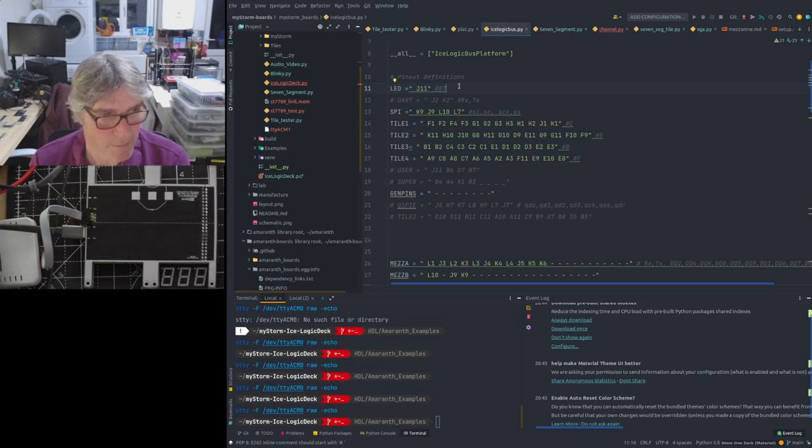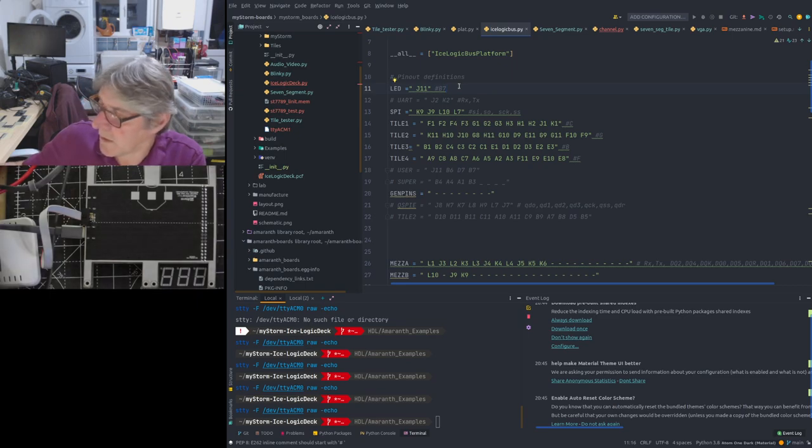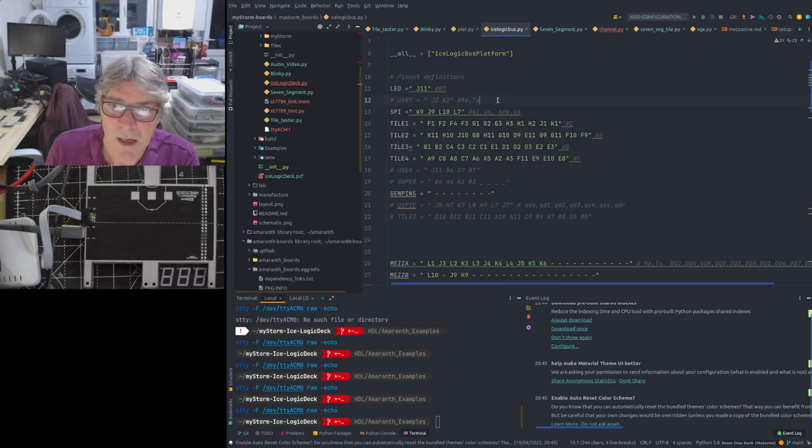So the color we get out is amber, which is a combination of the green, which is always on, and the red from the done signal. So that's how it starts up. So if you were to look at the board, you'd see the orange of the STM32 mezzanine board, the BlackIce NXT board, that is an orange, that RGB LED. Likewise, the FPGA LED is also orange. Confusing much, but let's just leave it there for the moment. We'll come back round to that. So the next thing I'm defining here, I've not defined a UART. Again, I want to talk about that later.